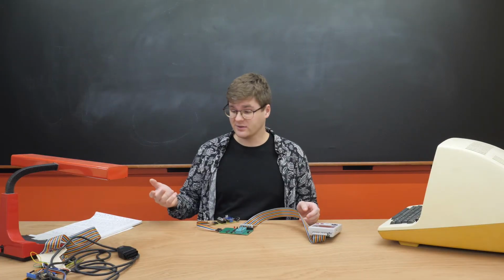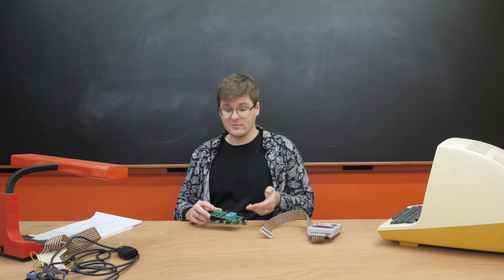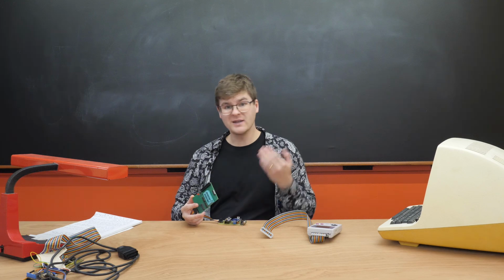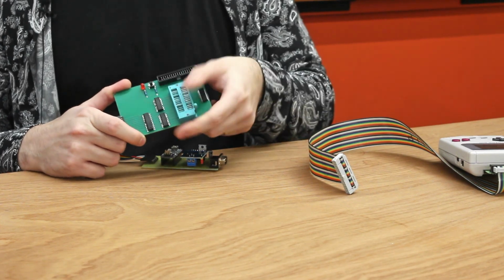That's right, I bit the bullet and sent some Gerbers over to China, a la JLC PCB. After that, I reworked the main interface board to make it a double-sided construction, which makes this so much smaller and reliable. Also added the ZIF socket up here so that you could change out the ROM real easy.